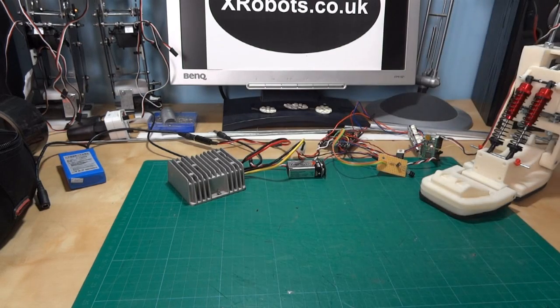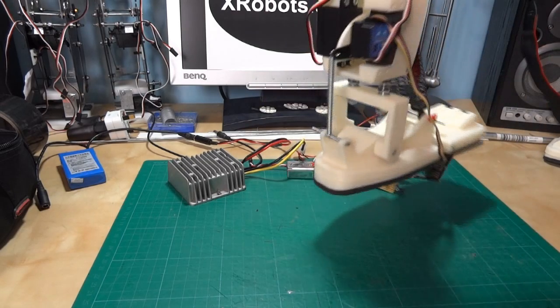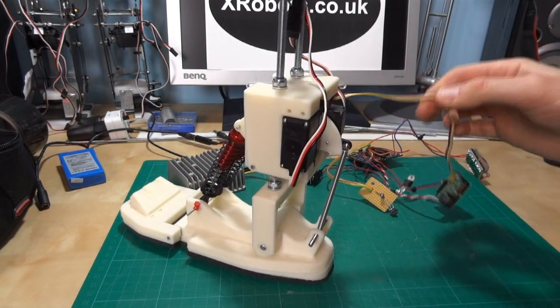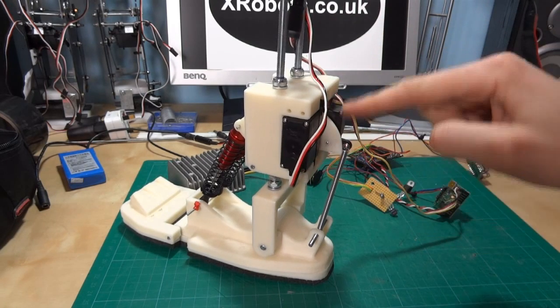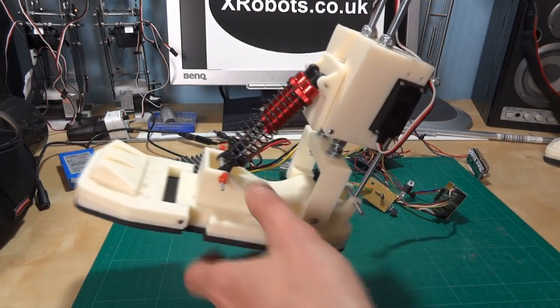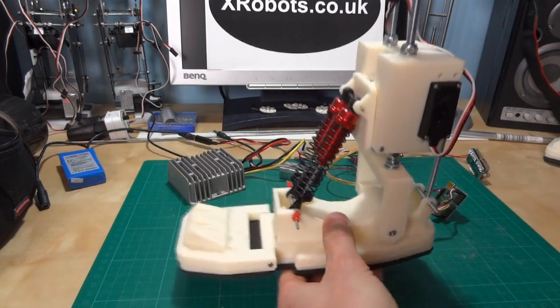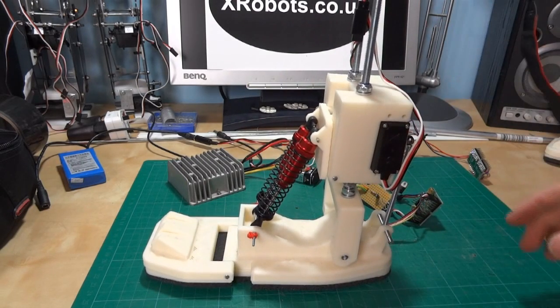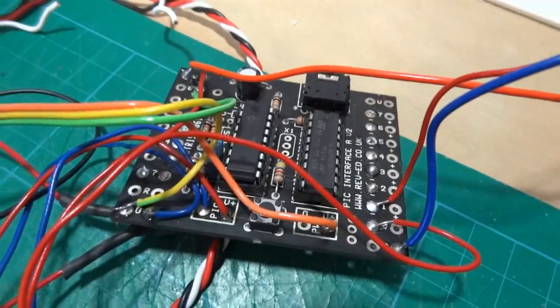The way I'm going to approach that — if I show you the other one which has a gyro installed — I have a radio control helicopter heading gyro which is basically just wired in line with the servo, and that will offset the servo quite quickly depending on the motion of the leg. The aim is to make it automatically kick forward when the leg reaches forward and automatically kick back based on the forward motion of the leg. The electronics I've got here are basically a Pololu Mini Maestro servo controller, a PicAxe 18X development board, and an infrared module with a remote just to turn it on and activate different routines.